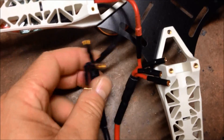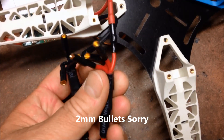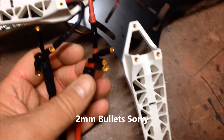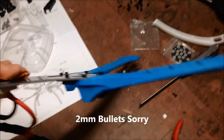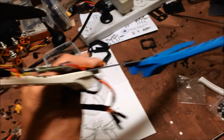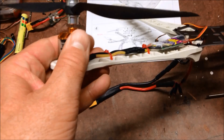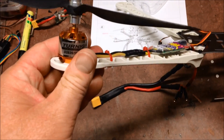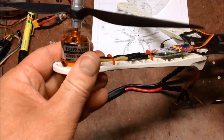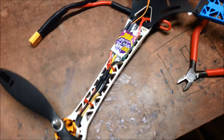I get to reuse my wiring loom that I built up for the SK450 — just 4mm bullets. You can see the upturn of the frame, which is the main reason I bought this one, to give it a bit more stability. With one motor on, you can give it a twist and it doesn't move a lot. That's about the same force I was applying to the SK450, and it moves about a millimeter, whereas the SK450 moved about a centimeter.